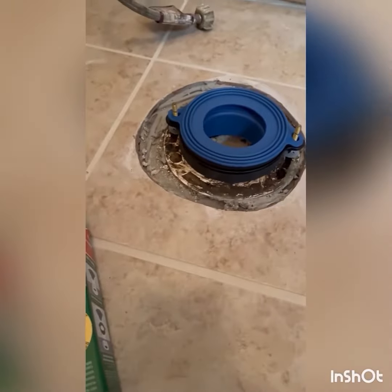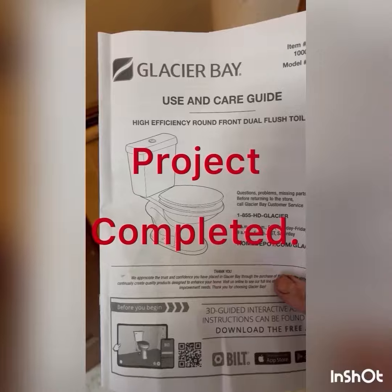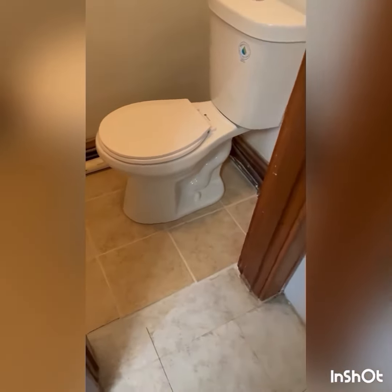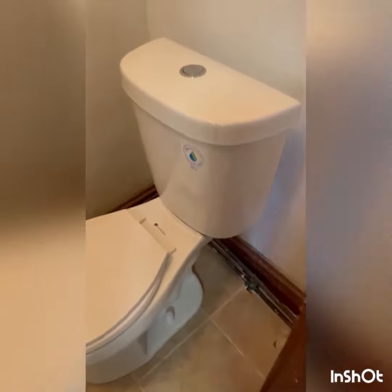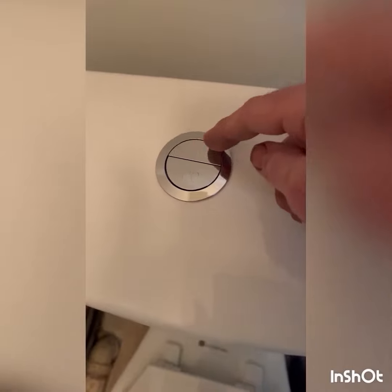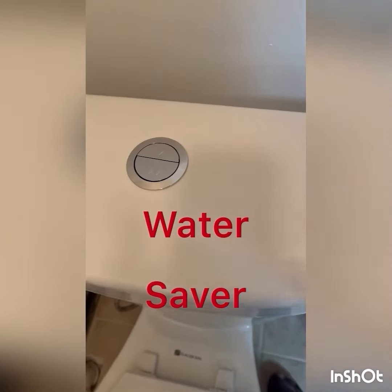It's better than wax — you don't have the mess. All right guys, we've got this Glacier Bay commode put in place, got it from Home Depot just a little bit ago. It's got the dual flush. You've just got to make sure that you get this single button lined up with the blue, or in this case, the black flush valve inside.